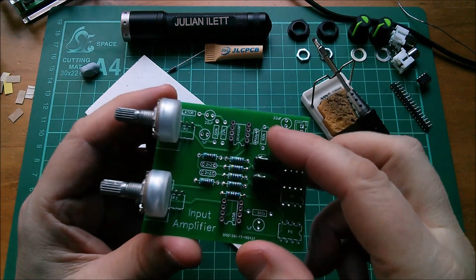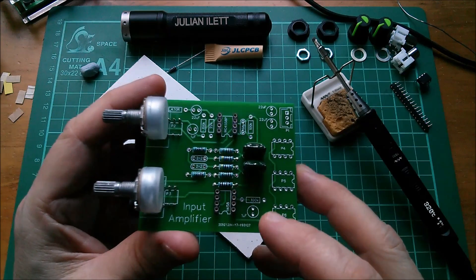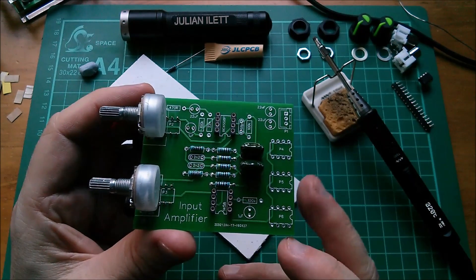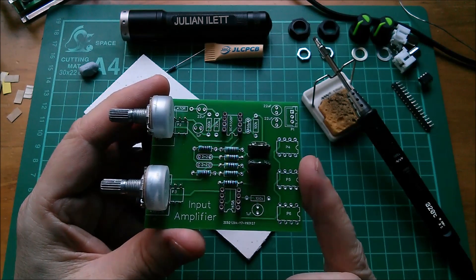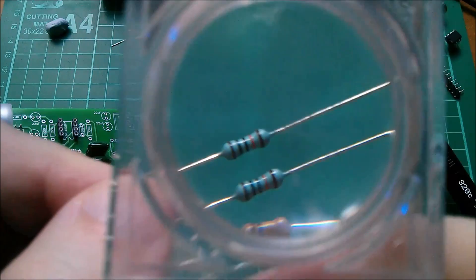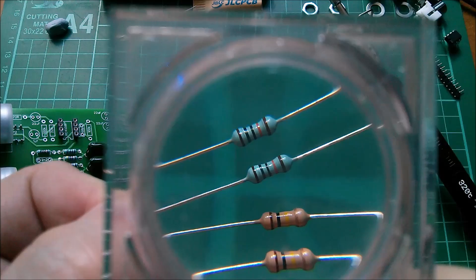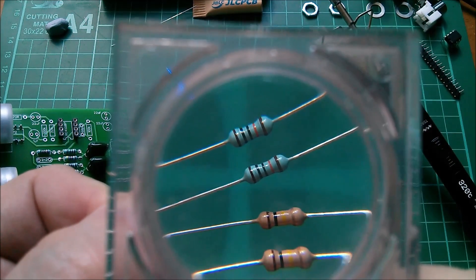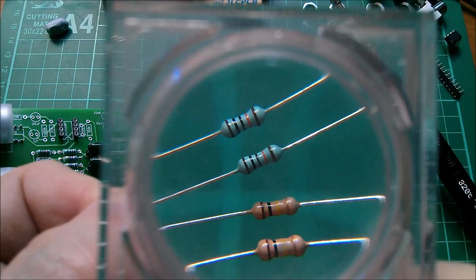So now I've got three 100k resistors to find. I've got some five percent three-band and some one percent four-band, so I'll get them both and look at the color codes. The color code for 100k on the three-band ones at the bottom is brown, black, yellow — for me that's always meant 100k, I can just see the number when I see that set of colors.